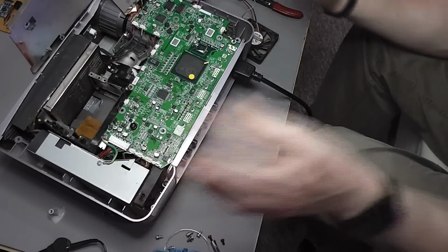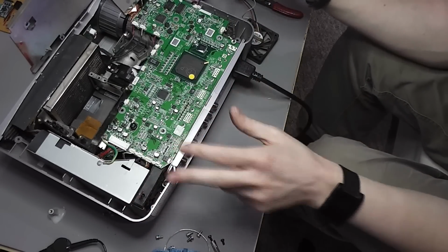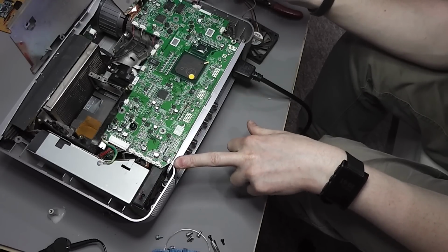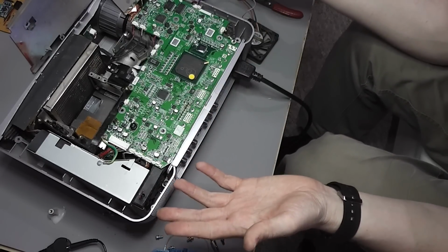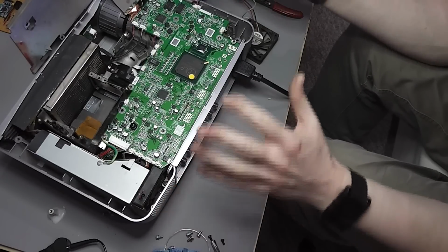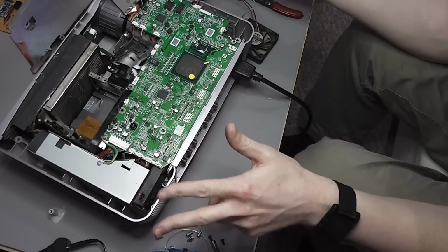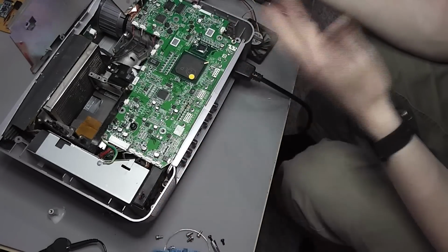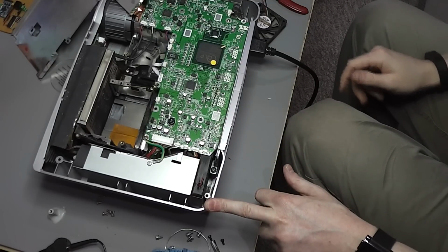Because if the fans are actually correct, then it's possible the fault, rather annoyingly, will lie with some kind of controller on the board. Again, that's still not too horrendous, because I can maybe power the fan from a direct 12 volt supply, so it's running all the time, and then hopefully this data line will feed back in. But it's the fact that two of these fans weren't powering on, it's a little unclear where the actual fault lies. So this fan works if I power it directly,